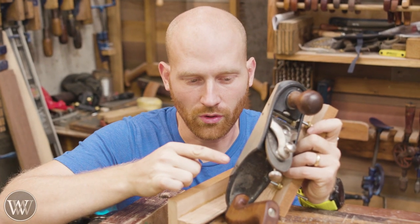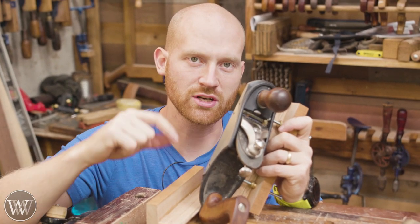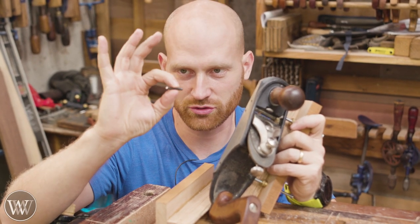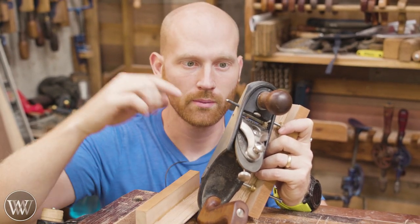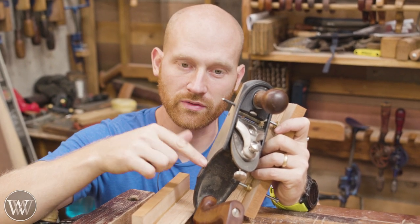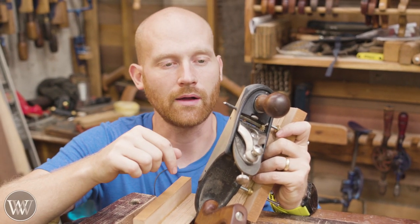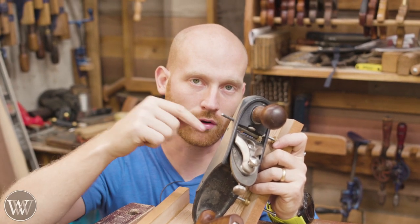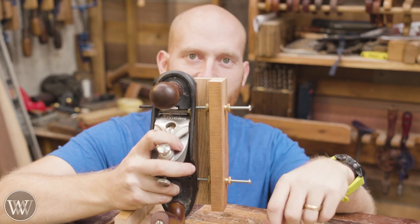Now I need to transfer the holes from the sides of the plane into the fences, and I want to get those holes precisely in the right location because I want them to be fairly tight. I'm going to make this little screw with a point on the end so I can fit it into one hole and transfer that mark. I'm going to mark one hole at a time rather than both at once, because if I drill one a little wobbly, I'm going to have problems with the second one. So if I mark one, drill one, and then mark the other off the reality of a bolt going through, it'll be much more accurate. Then we'll be mounting them together like this.